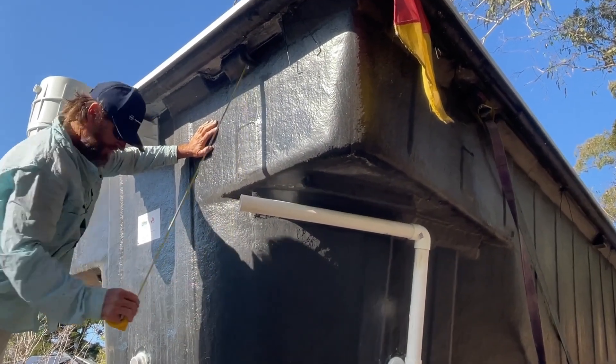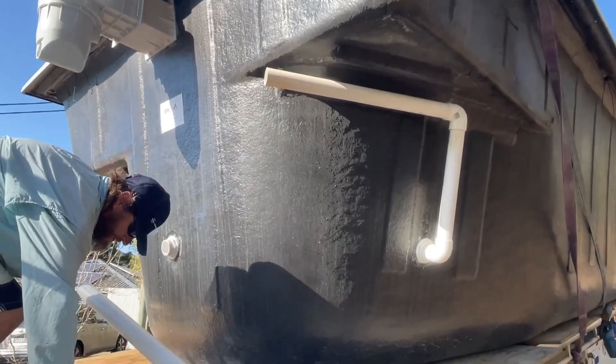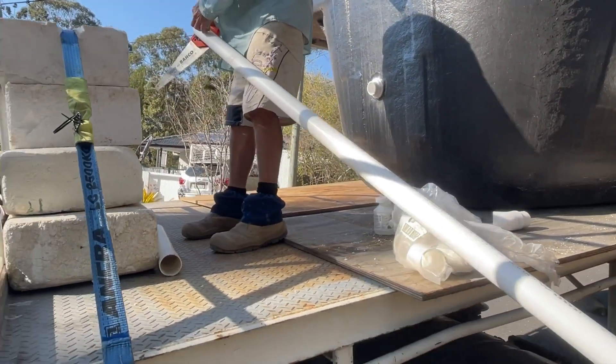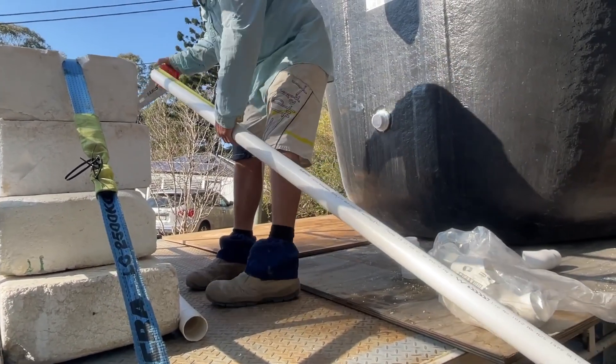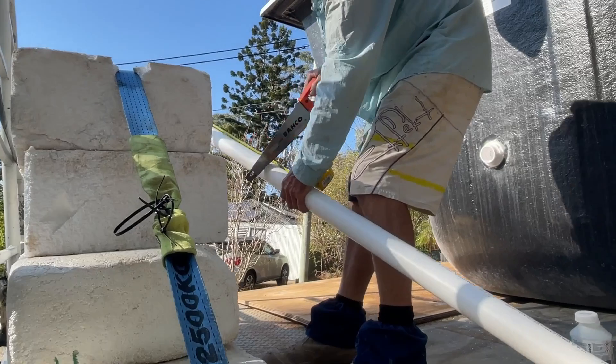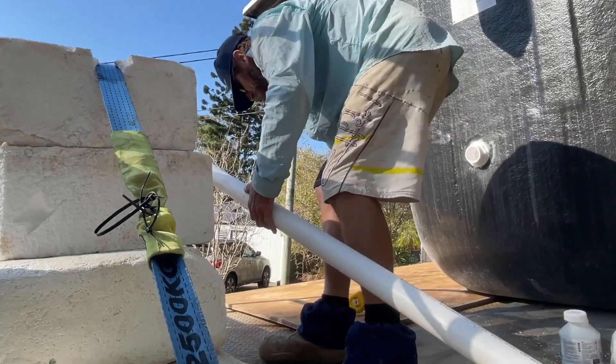With this pool the safety suction is mounted on one side of the pool and the other is in the middle. Often they're going to be in the middle of the deep end pool wall and they're going to be 900mm apart centre to centre, but we thought we'd show you this one because there's a couple of extra steps with it being off to the side.